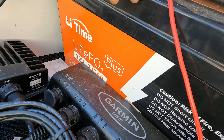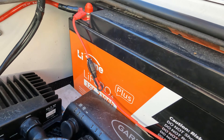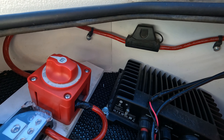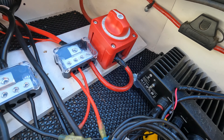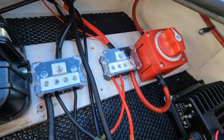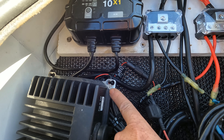The battery I'm running is going to be a 12 volt, 230 amp hour — kind of big but it fits, barely. It's going to be on 4 gauge wire with an 80 amp fuse to the kill switch, then 4 gauge from the kill switch to the distribution block, and then 4 gauge to the other end of the battery. I've been thinking about moving the LVS 32 to the transom. This is my water ground — it has continuity to the screw, so on an aluminum boat you can just grind off the corner, screw it down, and it water grounds it.